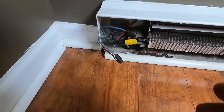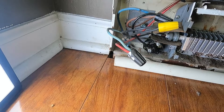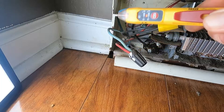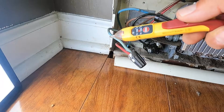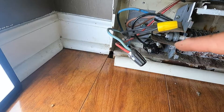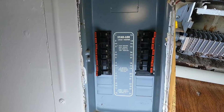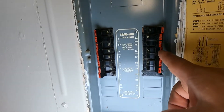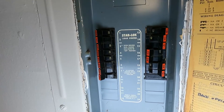When you don't have heat, go to the heater itself and make sure you have 240 volts coming from the thermostat. Power comes from the breaker box through the wire to the thermostat and then to the heater. If you have power through the thermostat but still no heat, the heater itself needs to be replaced. These heaters are on a 30-amp breaker, so turn it off before you work.